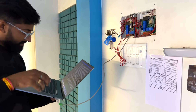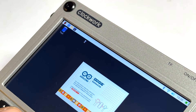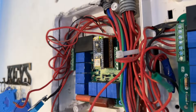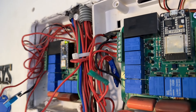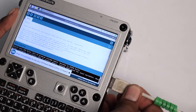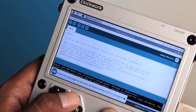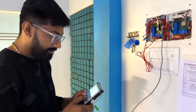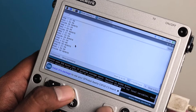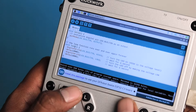As an IoT electronics project maker, I often need to debug projects using the Arduino serial monitor to see what's going on inside the microcontroller. Sometimes the project is in a location where it's not practical to use a laptop, but with this device my task will be much easier. I already installed the Arduino IDE on the uConsole, and here is one of my IoT projects running. I connected the USB cable to the board, connected it to the uConsole, selected the right COM port, and opened the serial monitor.